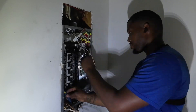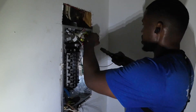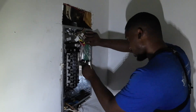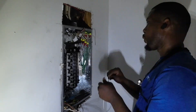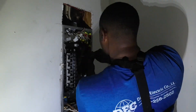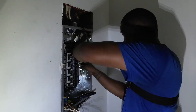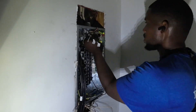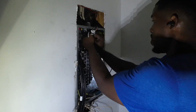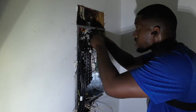Right now I'm working on the neutrals. That right corner is getting a little tight, and I have to leave the left corner open so we can get our main wires in — that's why you see all those wire nuts. It's a little challenging, and I wish it looked better because I know what I'm capable of, but not every situation is going to be ideal. Now I'm getting ready to start splicing my hot wires, which will be going on the left-hand side, and I'm still making sure I'm keeping track of which breaker each wire goes to — whether it's a 20, 30, or 40 amp breaker.